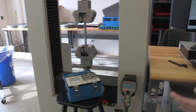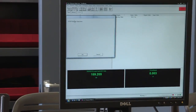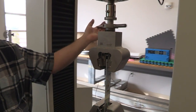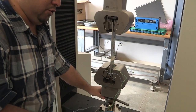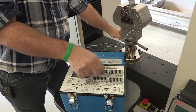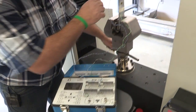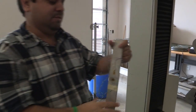When the test is complete, click stop. The software will say 'remove specimen.' Release the load by untying the top grip — the load will return to zero. Remove the specimen from the bottom grip and disconnect all wires from the strain indicator. Do not touch the strain gauges — we don't want to damage them. Then install the steel specimen and repeat the procedure. It's a very short test overall.